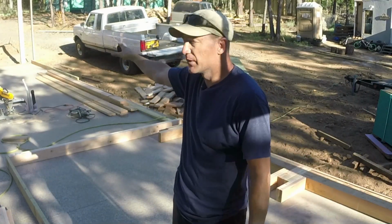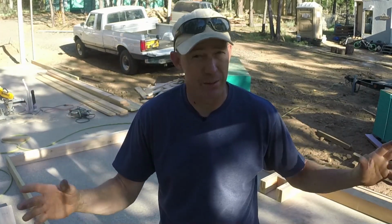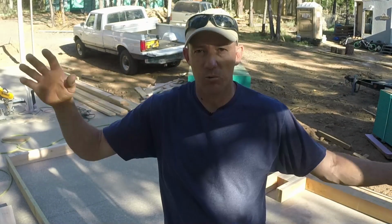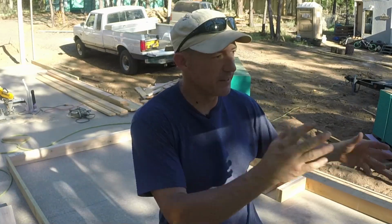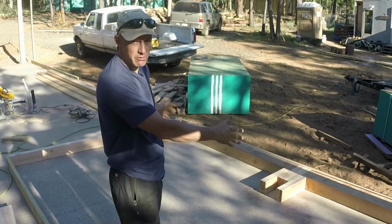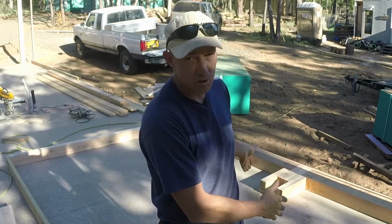This wall and the master bedroom wall down there, I had to shorten that window up. Both those windows are supposed to be 6 foot long. It's not a big deal. I made sure, and I made the window on this end and the window on that end basically the same size. I say basically, probably within 1/4 inch. So there'll be the same size window there as it is down there. We won't be ordering windows that are 1 inch different and trying to figure out which window goes where. I wanna try and keep the majority of the windows, or as many as I can, the same size. So I have 2 that are 5.5, and now I have 2 that are 6. Now, if this wouldn't have worked out, I would have taken both the headers out, and I would have shortened them by 1 inch or 2, depending, so that both these windows would still be the same size.